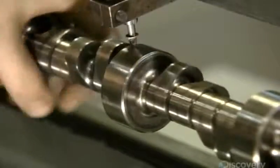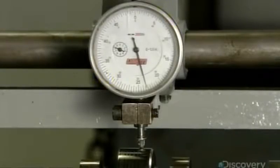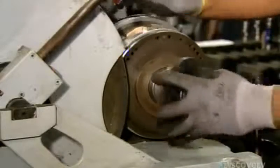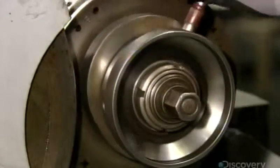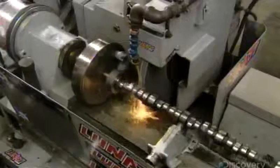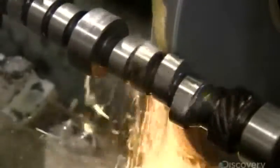The camshaft must also be completely straight, so the technician measures it from one end to the other and makes adjustments where needed. Next, he selects a master template of a camshaft lobe and places it in a grinding machine. This master is the pattern to be copied by a grinding wheel. Once it's been locked in place, he activates the grinder. It carves into the camshaft as it rotates and rocks back and forth in the machine. The grinding wheel moves down the camshaft to shape all 16 lobes to the exact contours of the template.